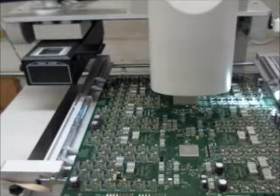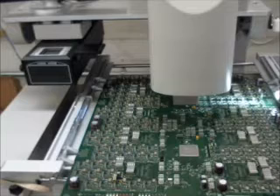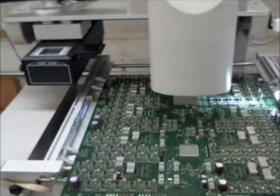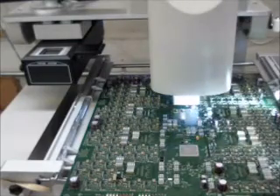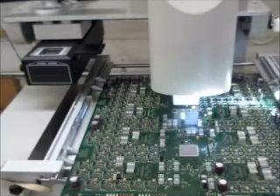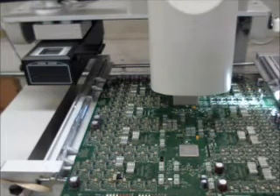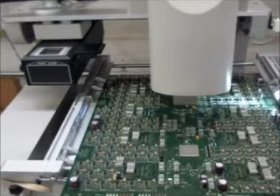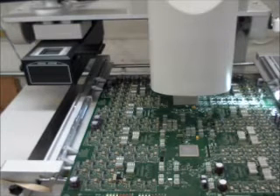So we're getting near the end of the profile here — 15,250. The board seems to be supported pretty well, so it's not warping that much. Looking — it looks like it's completely reflowed, a little sooner than expected. So we're going to go ahead and check our temperatures. It's just into the end of the profile, so we're going to stop it because I'm pretty comfortable that it's down all the way.